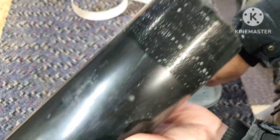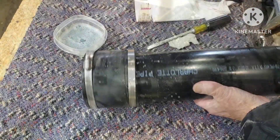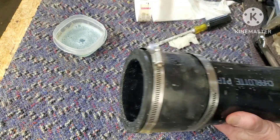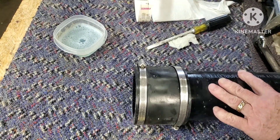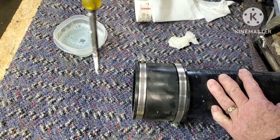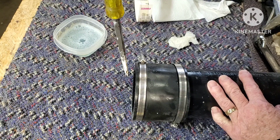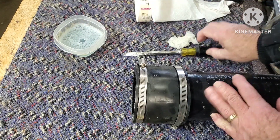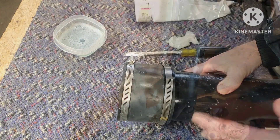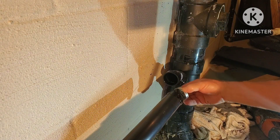You're going to have to slide that boot all the way on to one side or the other — either up or down — but it has to go all the way up to be able to get this in there. You've got to tip it sideways a little bit to get it in there, and that's why you leave a little bit of space between the two pipes, so you've got room to get it in and then slide that up halfway on each one and tighten it up. Plan on this thing fighting you — that rubber boot can be kind of troublesome sometimes.